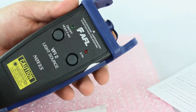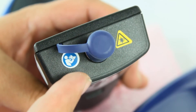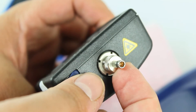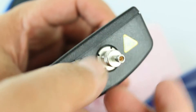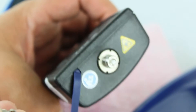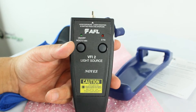It does include a nice rugged protective boot. It has a universal connector interface for quick connection — this particular unit is the 2.5mm size, which is most common with ST and SC connectors. You unscrew and remove it when needed. There is an additional piece sold separately for LC connectors, since the LC connector is a little bit smaller. When you need to use an LC connector, just remove the 2.5mm adapter and put the proper one on.